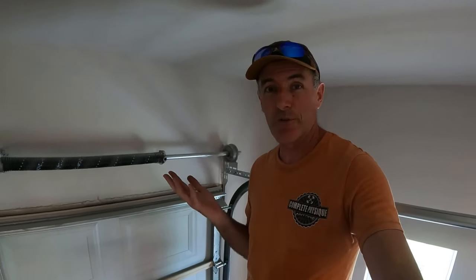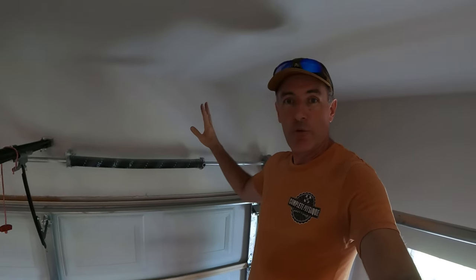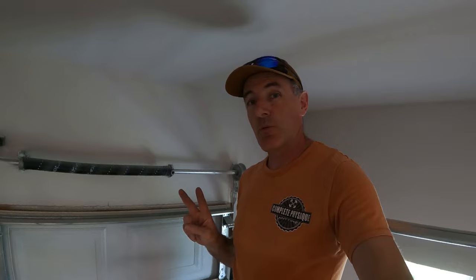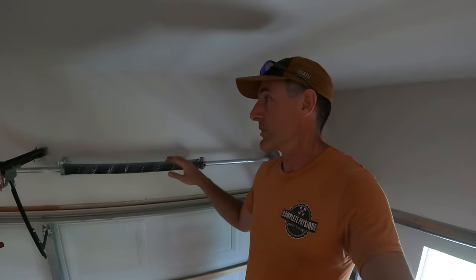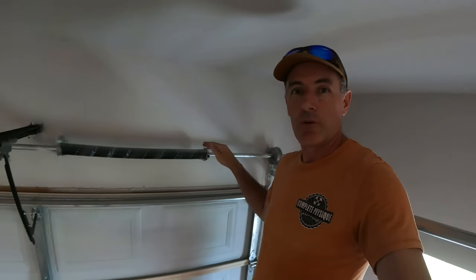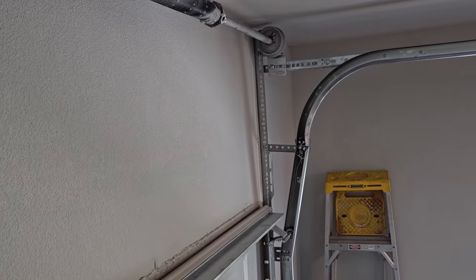This isn't going to be a how-to on raising your garage door — I'm not qualified to do that. There are three ways: call a garage door company and have them handle the springs, track, and everything; go online and order a kit with track extensions, correct cables, drums, and new springs (I priced one out at $300-$400); or do what I'm doing — buying longer cables off Amazon, raising the spring and drums up toward the ceiling, and extending the track by cutting off the end piece. I'm only raising it about 17-18 inches on a light door.